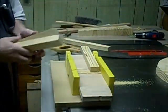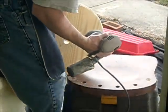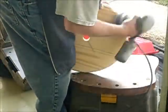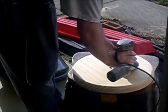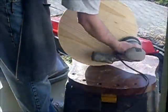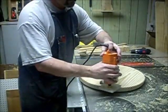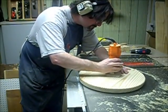Nice and quiet — that's what I like. After cutting the cross braces to length I took the seat outside and set it up on my short man's bench, used the leg vise, and rounded over all the edges with my disc sander. Once I got the edges rounded over to my liking, I took a 60-grit sanding disc and sanded it to a smooth finish. I further refined the top edge using my laminate trim router set up with a quarter-inch roundover bit.